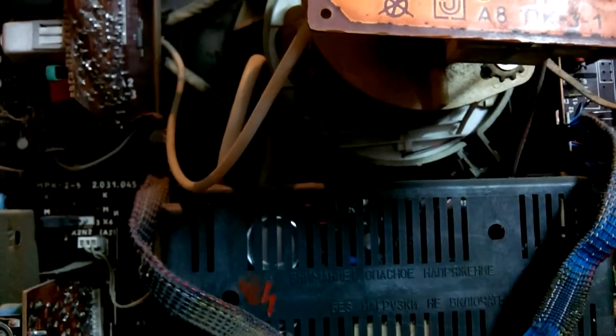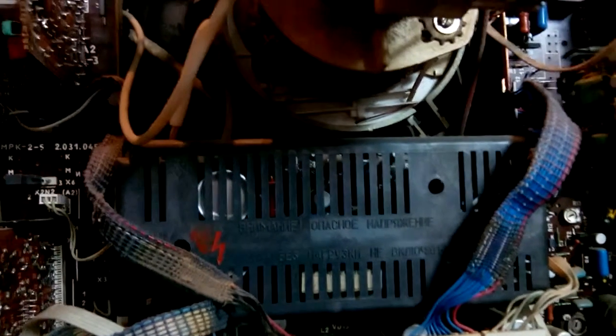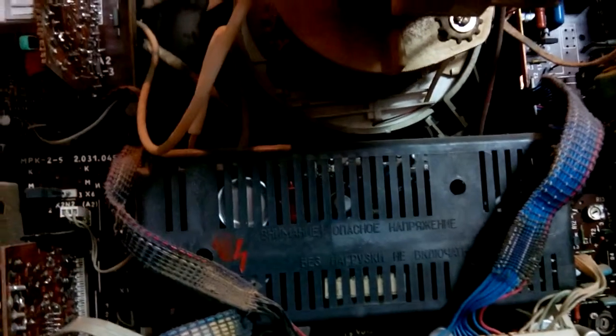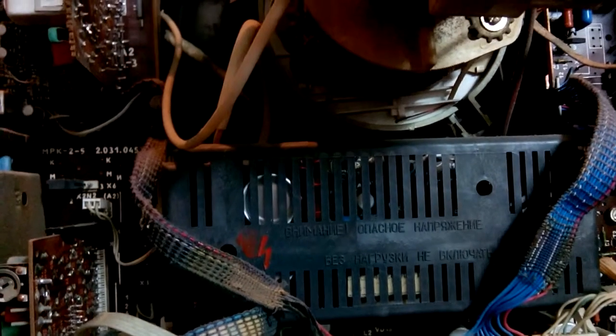Let's say I got a TV that is completely dead and has a power supply blown completely — lots of components blown, a lot of work to put in — and you probably end up with a TV that has a bad flyback or something like that. That's where this power supply is very nice, because I can adjust it a little bit, adjust the voltages to get them right, plug it in instead of the original power supply, and see if the TV will start up. If the TV starts up and everything is nice — flyback is okay, horizontal output transistor is okay, vertical deflection is working, picture tube produces a nice image — then I will invest the time and effort to repair the original power supply.